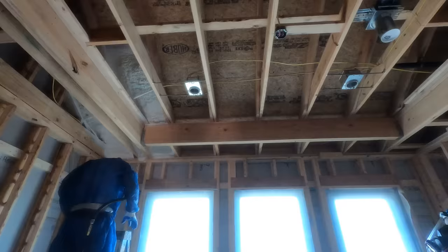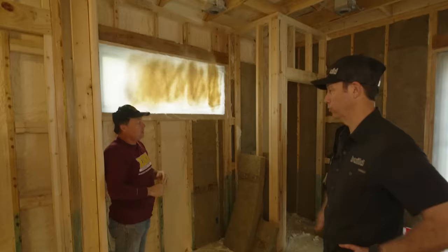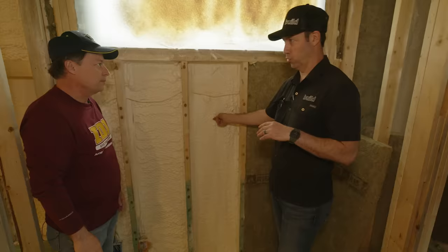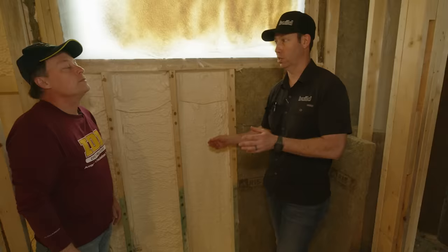On a ceiling, we have to do a lot more. So when we flash and Batt on a ceiling, we're typically at 3 inches and more of closed cell spray foam. Yes, in some cases it's gotta be over R25 on the roof deck. And let's just review our science here. This is closed cell foam, which acts as a vapor barrier, meaning that there's no drying happening through this. One nice thing about closed cell is it's a vapor barrier in both directions, right? We're not gonna be able to have water go through this and condense on a cold sheathing, if there was such a thing. Yes. And we're also not gonna get drying in this direction through here. So we have to be a little cautious.